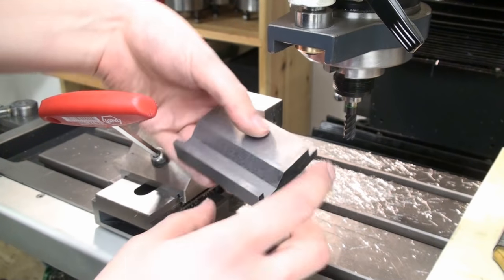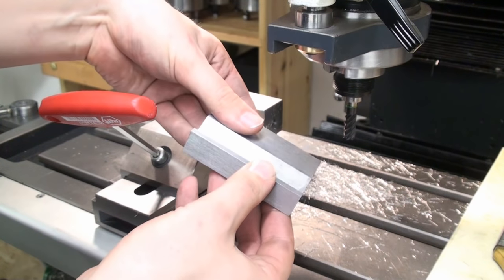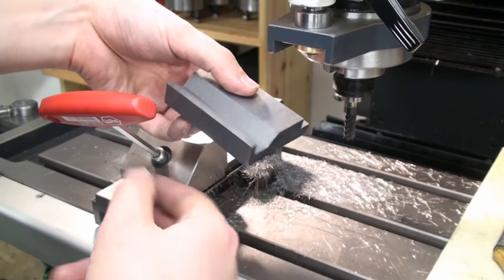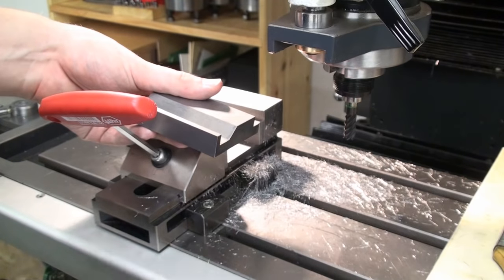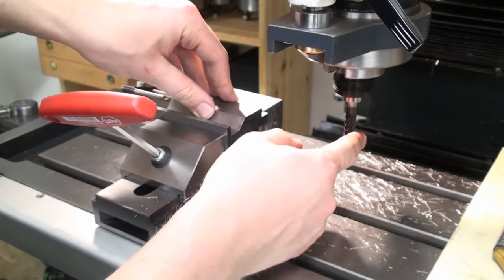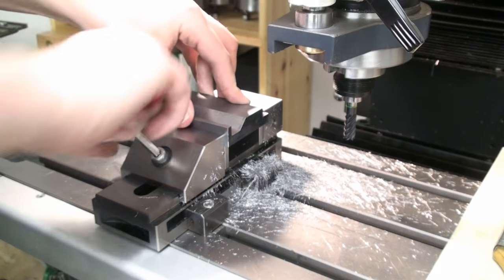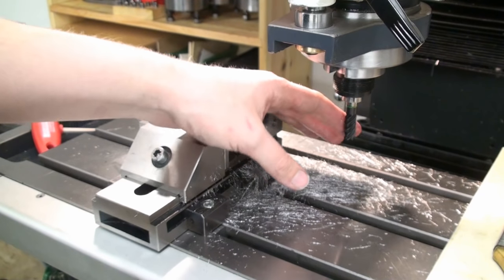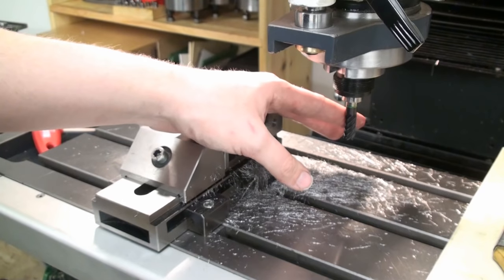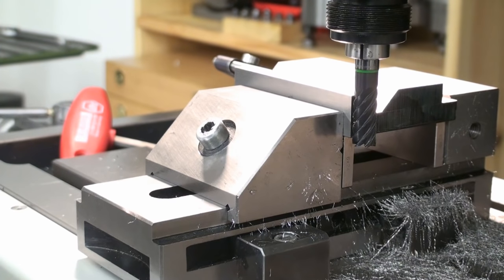And I do this because it's easier to clamp it that way when I have the big piece of material holding on to it, and then the smaller ones can be clamped against a stop and also be side milled. As for the surface finish, I'm using a nice coated 6 flute carbide end mill, brand new. eBay end mill. This would probably be a $60 end mill. So yeah, not the cheapest option out there. Okay, we're running it at 1000 RPM and we're hand feeding.